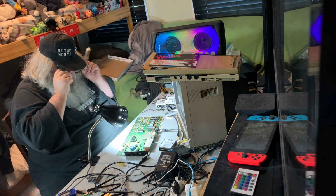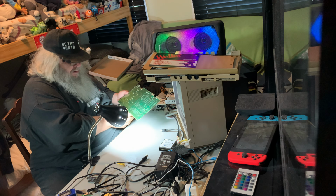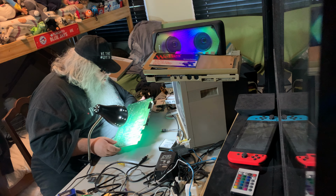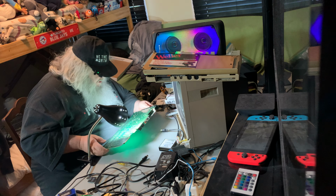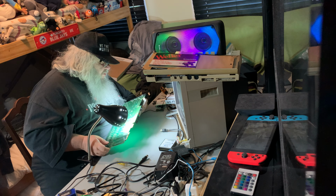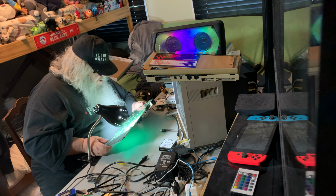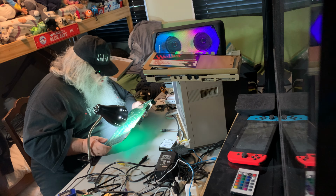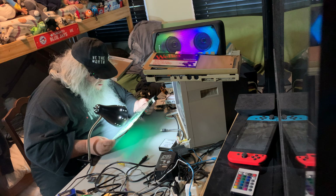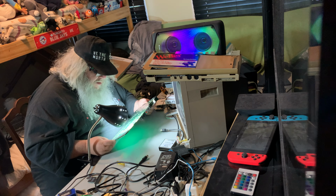I'm going to put on some stronger glasses, and I'm going to look very carefully under the light at the board to look for anything that looks deficient. The things that are often trouble are the connectors at the joysticks and the power connector. Those are the ones, if anything is going to break, it's usually them. And also the monitor and the serial port, because they got things put in and out and in and out.